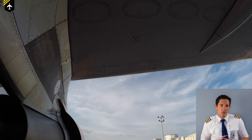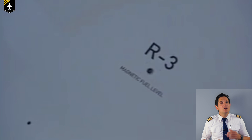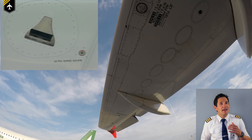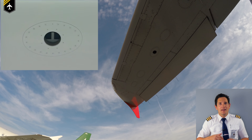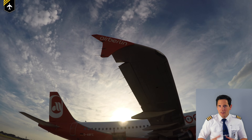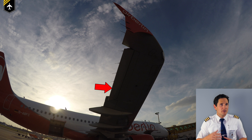Walking to the right-hand wing leading edge, check the condition of the slats. Make sure the refuel coupling filler cap is closed, and verify that the fuel level indicators are flush with the wing with no leak from the fuel water drain valve. Verify that the surge tank air inlet is clear and that the overpressure disc isn't cracked or missing. Check that the navigation and strobe lights aren't damaged at the wingtips, and check if any static discharges are broken or missing. From this angle you can also quickly scan if any of the upper fuselage antennas are broken or missing.